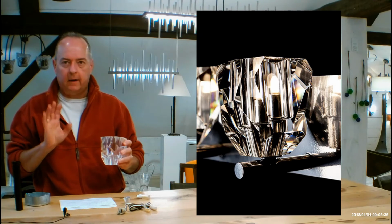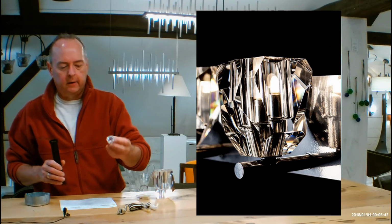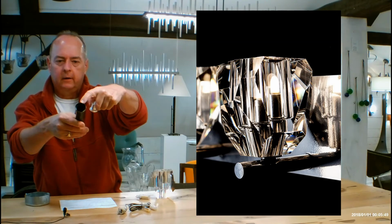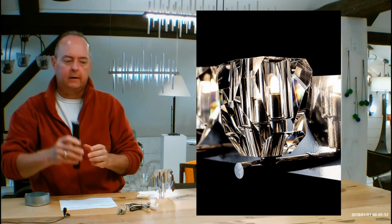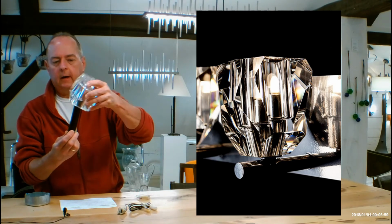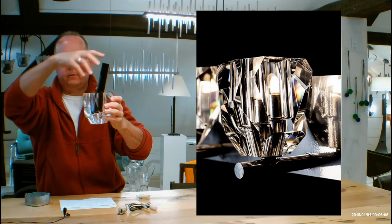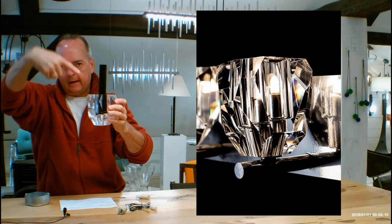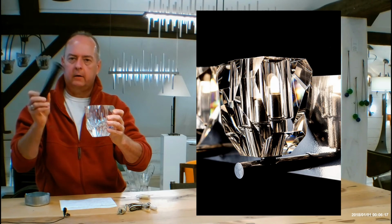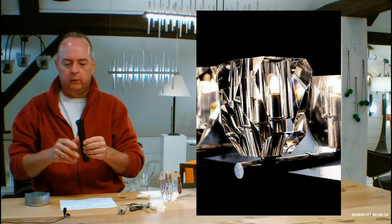Now, when you are putting this onto the fixture, you'll notice in the installation instructions that you're going to have a couple different parts that come into play here. It's going to be using this retaining cup that has threading on the inside and these little ridges. This is a retaining ring tool that has little ridges here too, and this is just going to drop right inside like that. What I generally do, to make it all easy, is take the piece of glass, regardless of which fixture it is, turn it upside down and go over the retaining ring tool, take the whole thing, and then slowly put it onto the fixture itself. Hold it on, and then use this as a proxy for your hand, right? Because your hand can't get in here. Righty-tighty, lefty-loosey. You're going to turn it until it's nice and snug on there. Take it out, and you'll notice that the retaining ring is going to be on there, so you don't have to worry about anything. And then just take this and put it into a junk drawer in your kitchen someplace and forget about it.